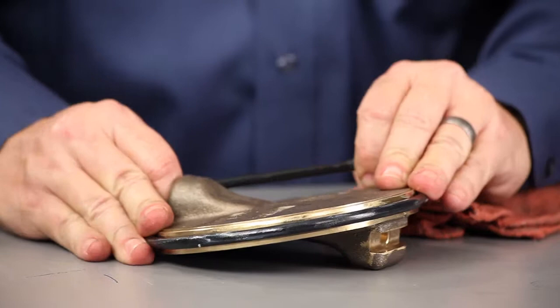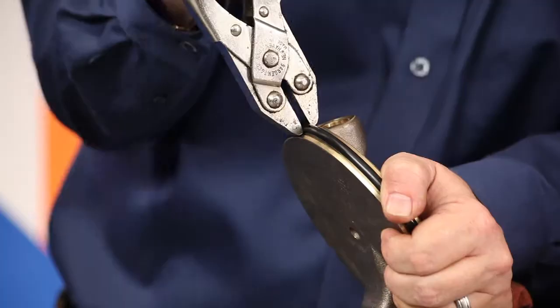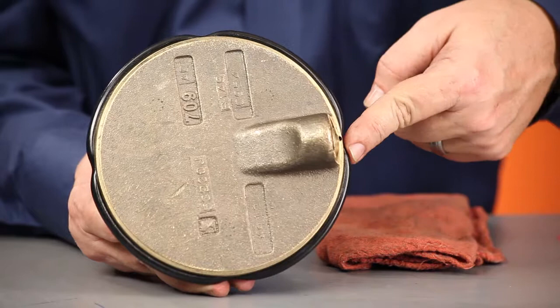Now, place the O-ring about halfway around the disc groove. While holding the disc groove in place with one hand, position the O-ring on the edge of the disc with the index finger of your other hand. With your fingers still under the O-ring, rotate the disc completely to equalize the rubber tension. To ensure equal distribution of the O-ring around the disc, press it into place at four equally spaced points.